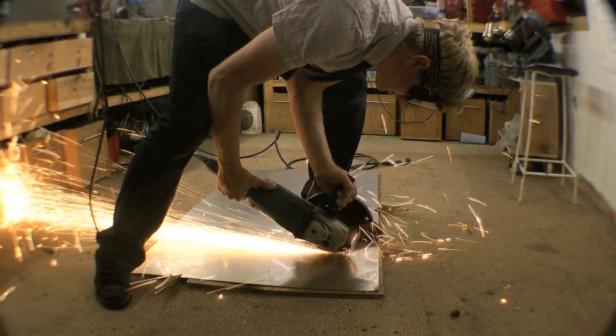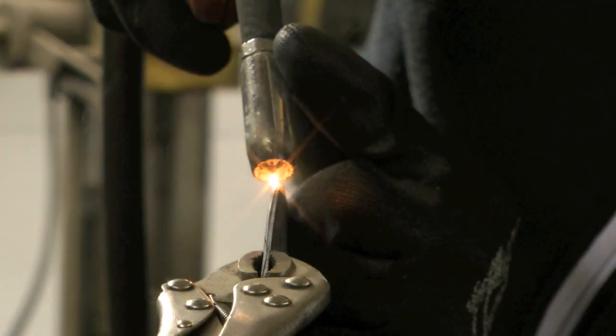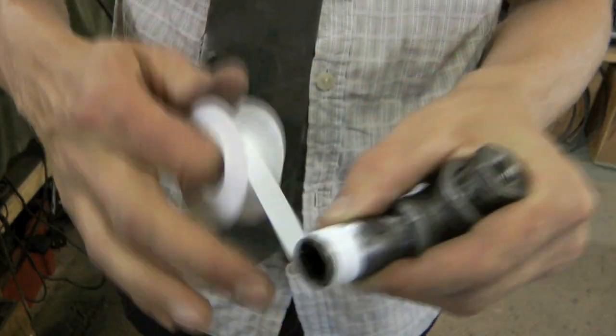We need something to form. To start with I've got some 1mm mild steel sheet. I've got a few different shapes cut out. Drill a hole in one of the plates, then weld the two together around the edges, and above the hole weld a steel plumbing fitting. You could also put this in the side or anywhere really, it doesn't matter. For the attachment I've got a load of plumbing fittings — I'll put all the links on my website where you can buy all these.